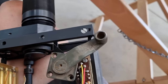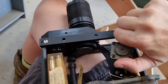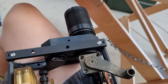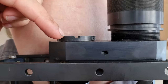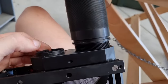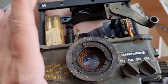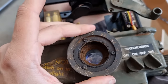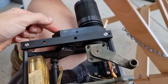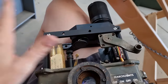Now let's go up again and revisit our changeover switch. This switch here is the same as that one there. All it does is move this rack left and right. This is our one times magnification, which is no magnification, and this is our four times magnification. Both of these are adjustable with the case off so you can screw them in and out to get your correct focal distance, and you just work them in tandem with this one here. None of this is new if you are familiar with normal periscopes — this is how basically all periscopes work. But that's not why you tuned in.